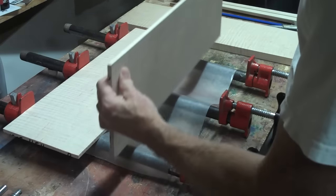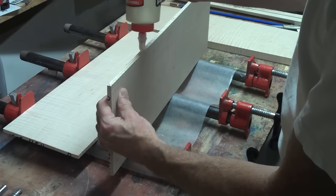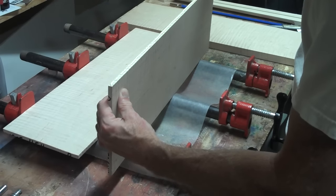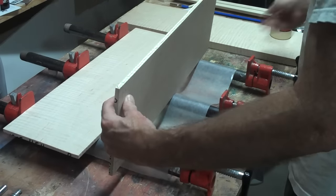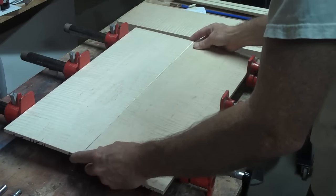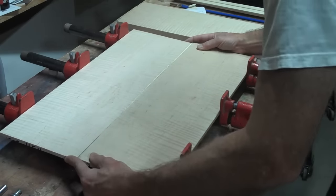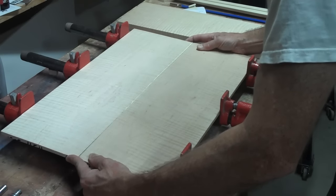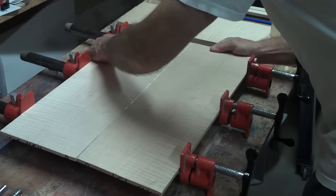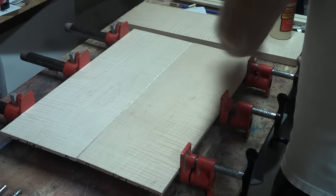It works wonderfully well. And I will just put a bead along the length of the glue edge. And bring the two together. Slide them back and forth a little bit to distribute the glue. Then I want to line it up to make sure that my figure is lining up across the seam. And then I'll just apply just enough pressure